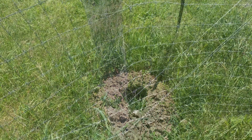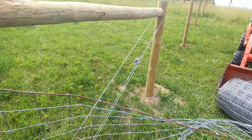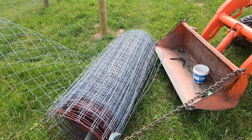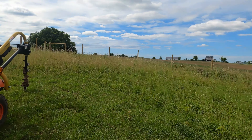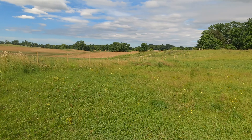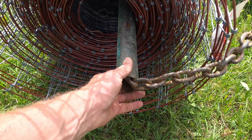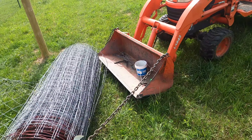I'm going to throw two of these little scab anchors on the bottom of each post to help them stay in the ground. Once I've tied this fence in to the post in the H-brace, I've hooked my roll back up to the tractor and I'm going to back the tractor all the way around the fence down there. I just ran a chain right through a pipe and put the pipe right through the middle of the fence roll — now we raise it up with the tractor.